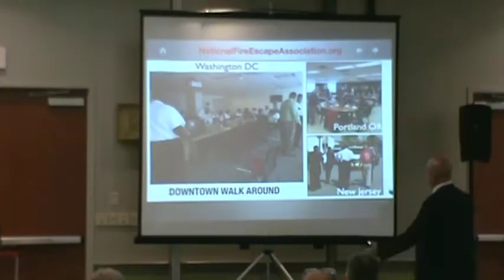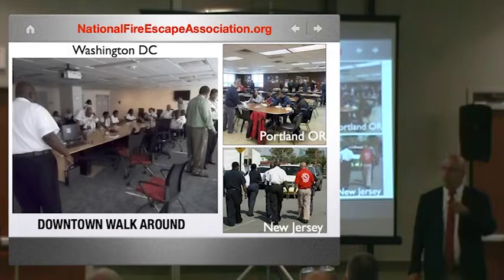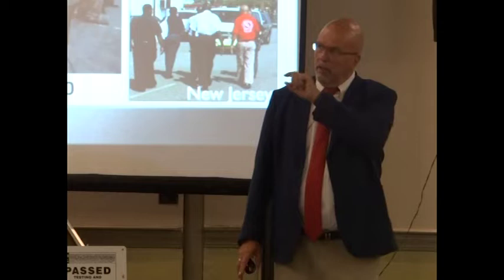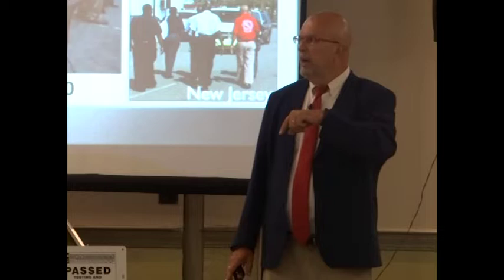Like I said, one of my first national classes was in Seattle. And a lot of them have done and certified the fire escape. One of my model cities here, if you guys ever want to start this program right off the bat and ask a fellow building commissioner, call the city of Lowell, which we've done about five or more of these seminars specifically for them, and they have a national model. So if you want to just download it off their website, and we gave you a copy of it in your paperwork. Lowell is the number one. Yonkers in New York is the IFC version of the same thing, and both of them include load testing if it's required because the building has the old bolts on the fire escape.